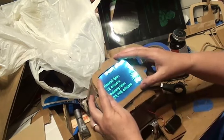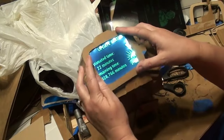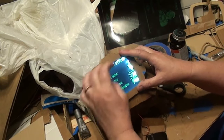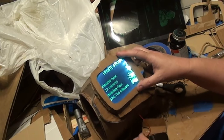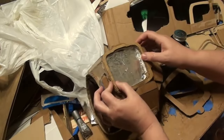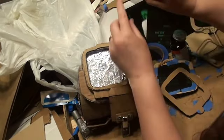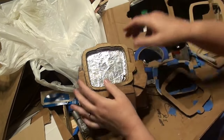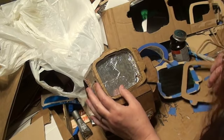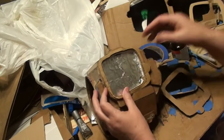Now comes the time to install the light that's going to go behind our screen. I would strongly suggest also trimming the walls inside the screen cavity with an exacto knife to be as even as you can reasonably make them — this is what the LED strip is going to stick to, so the more even it is, the more surface it's going to have to stick to. Take that screen part you removed from layer three or layer four and trace it onto a piece of aluminum foil, smooth that foil out as much as you can, then super glue that into the very bottom of the screen cavity, smoothing it down and making sure none is on the walls.